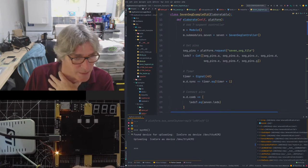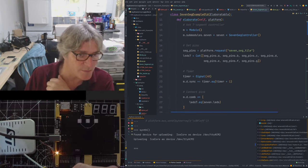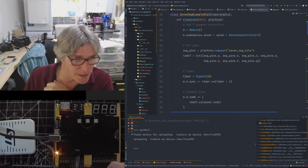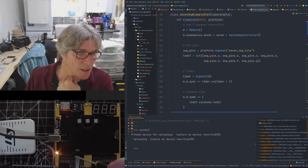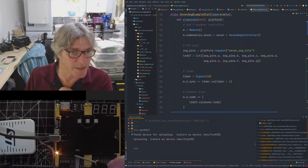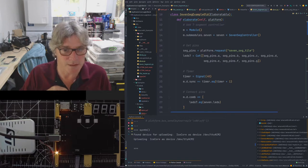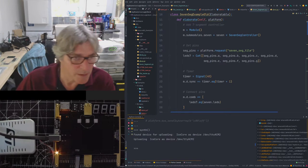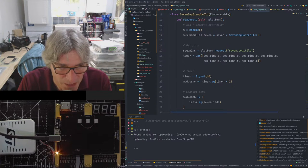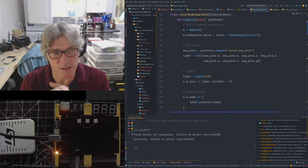I also currently have the debugger plugged in. This is the ST-Link. Excuse me. And that's got an IDC cable here that goes into the standard ARM miniature 10-pin JTAG connector that's on the BlackIce Nxt board. And that's carrying SWD debug. It also has an SWO monitor, so we can send messages back from the Rust embedded firmware in a very efficient way without having to use peripherals. Makes debugging easier. And that's using Rust Probe on the host side as well, which is nice.